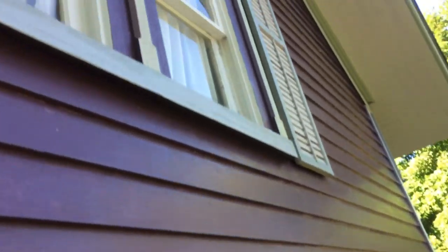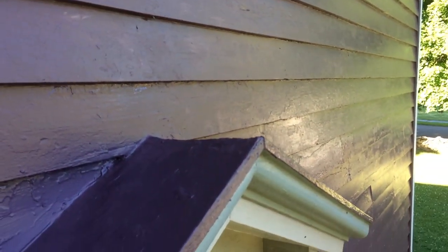I'm almost halfway on this side on the second coat. On the number of coats — we're never able to do it in one coat. We do a primer that we tinted about four times more than they'd normally like to tint it at the paint mixing place, but we're persistent and have them do it. We still need two or three coats — you can see some coming through. Most of the time we're doing three coats. I'm only going to do two on this side here since it was painted before, though we hadn't let the siding dry enough when we started painting.